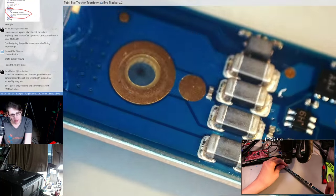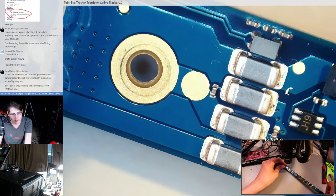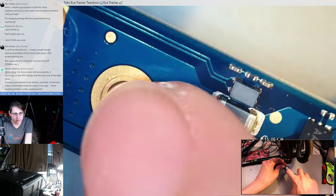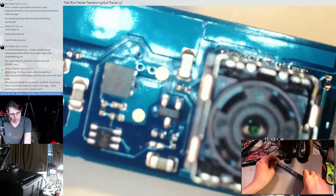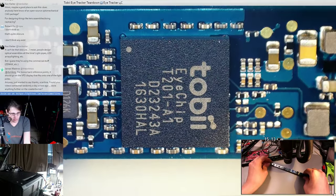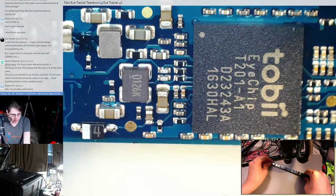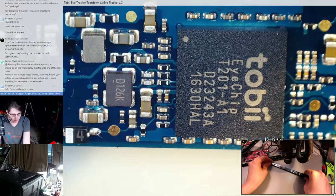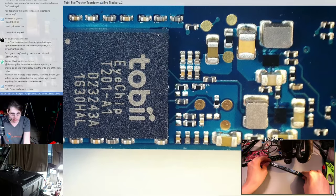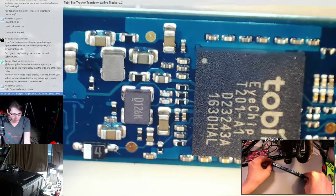And likewise, over here, I'm pretty sure that that is via in pad, so they're actually invisible vias stitching through the rim of this gold ring here. Neat. Any good candidates for USB coming in sideways, or you think they would come directly up from another layer? I don't see any components that they would need here. You assume that they would probably not need any serious termination right next to the chip.